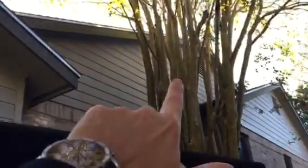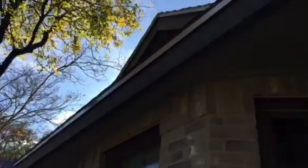Again, this gable's been done, this window box has been done on both sides. We're really just doing this rake wall right up here, wrapping the gable vent up top there in a 1x4 Hardie. And then coming around to the front here, again, you can see the soffit just needs to be painted. There's really no areas of the soffit that look like they're in really poor condition. Fascia definitely needs to be done, no question about that.